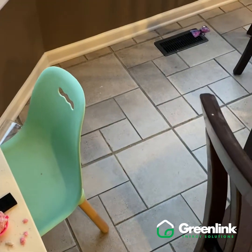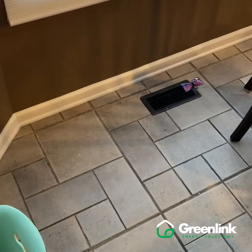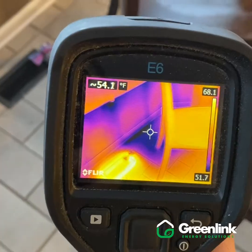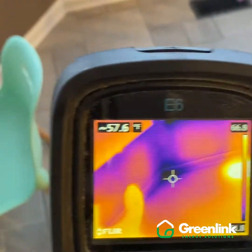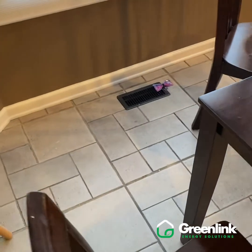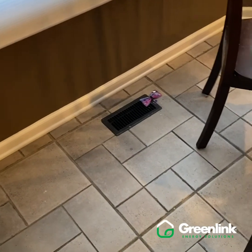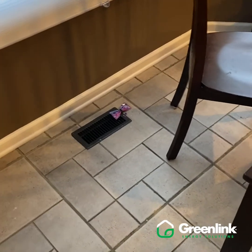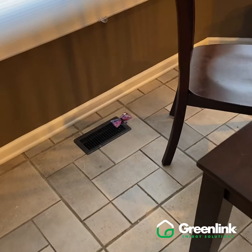This is a view of the floor from above where we were talking about that cantilever in the basement. We can see the supply duct right there — this floor is just very cold. There are some dark purple spots and a pretty distinct line showing where the floor hangs past the foundation, allowing cold air to work through the floor system. When we lay down tin metal, seal up the bottom, and spray foam it with our closed cell spray foam, we'll seal it all up, insulate it, and even add a little structural strength. That will allow for a more comfortable space below and above that area.